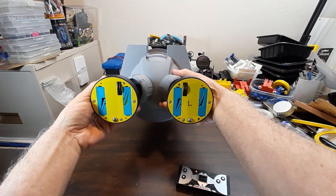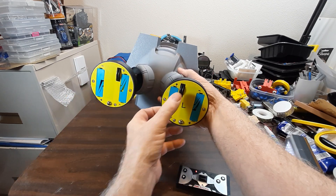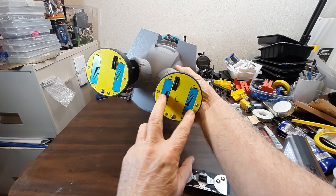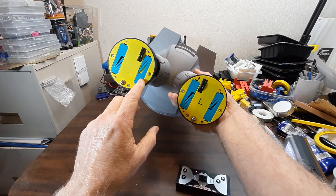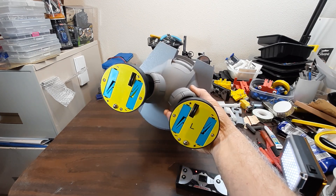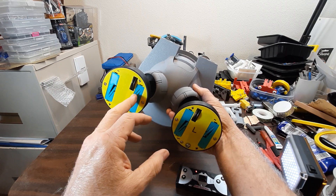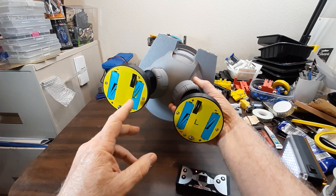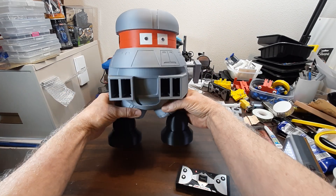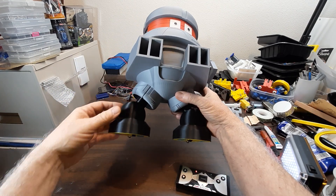Here's the bottom of it. For those who didn't see the last video, it's got drive wheels with o-ring tires and little ball bearing casters. It runs on four double-A batteries, although right now it's only running on three — there's just a dummy battery in here. I wanted the option to run it on four and a half or six volts depending on the controller, and I also knew I needed weight in the bottom.